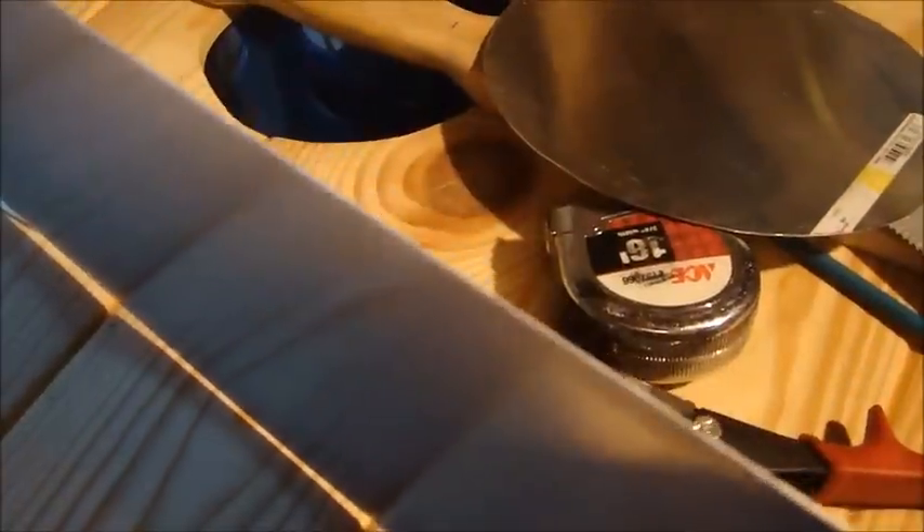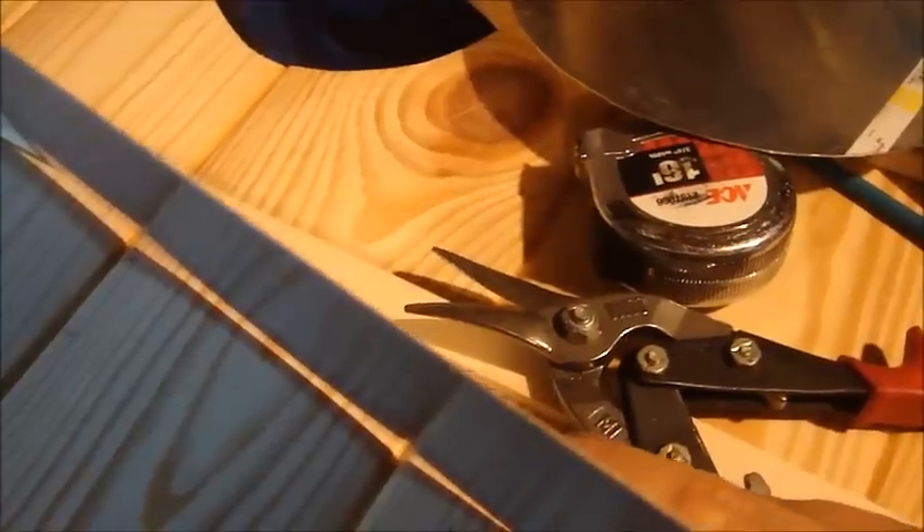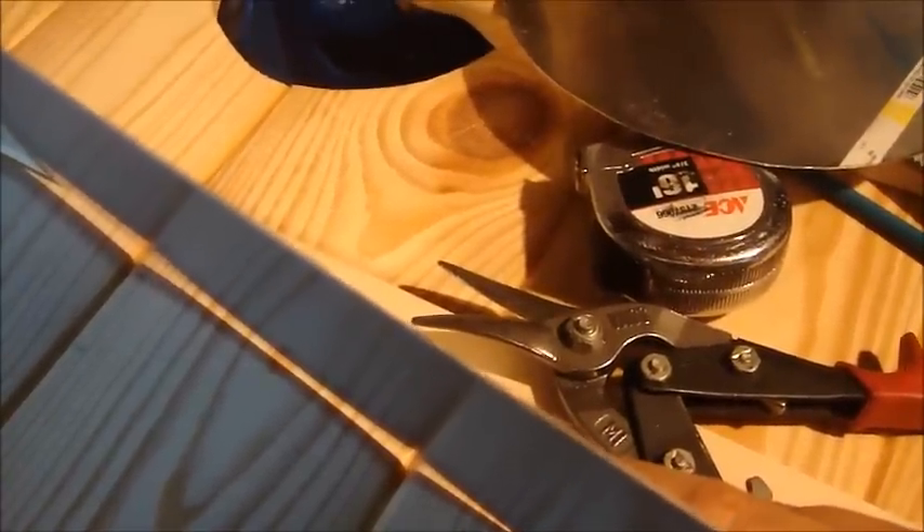The aluminum is light and nice and soft, so it'll be easy to work with. The really thin thickness might be an issue, simply because we're going to be stretching it quite a bit. As we're hammering on it, we're actually stretching the metal out, and if it gets too thin I might punch through it with a hammer. I'm going to try with this thickness, and if I have to I can move up or switch to steel.